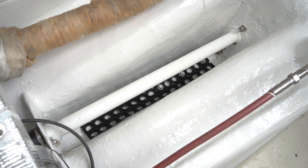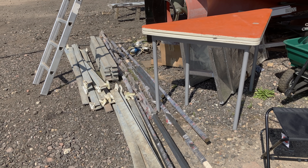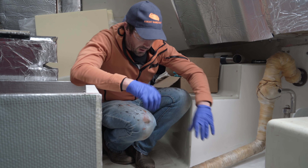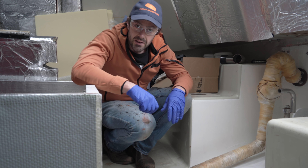I'm not going to go with lead — cost, environmental concerns, all sorts of other reasons — and I was able to get hold of a fair amount of galvanised steel. I'm going to pack as much steel as I can around the areas that are basically dead volume, right down in the bottom of the boat, as close to the keel as I can possibly find.